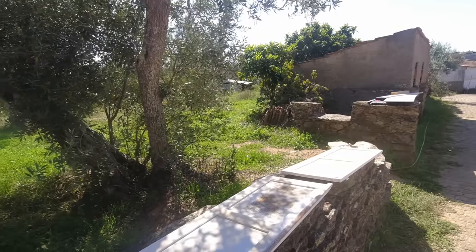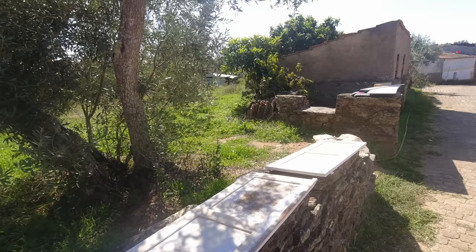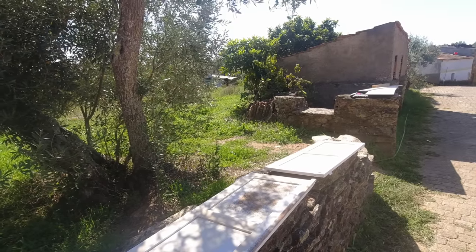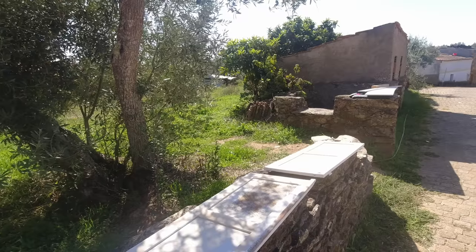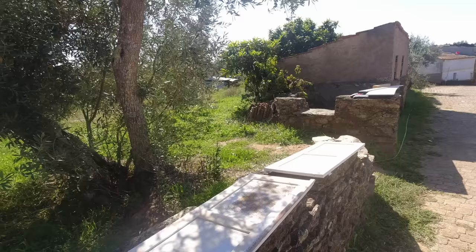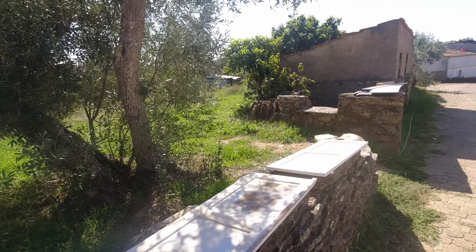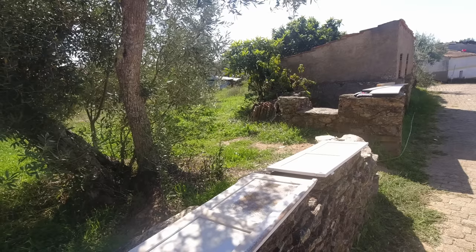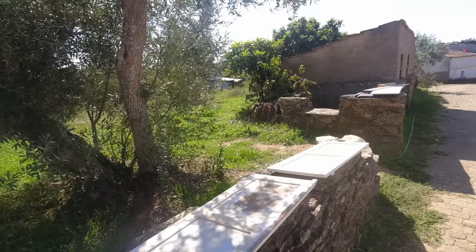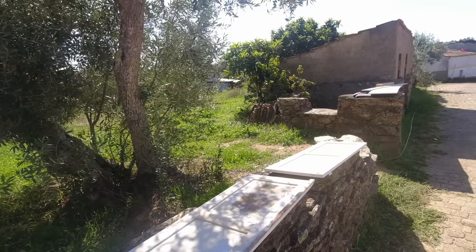Here's my workstation under the shade of an olive tree. I'm just painting up the shutters — they're quite rough, not the most fabulous, but they do an excellent job. They were all painted dark brown like the rest of the wood in the house, so we sanded them yesterday. Now I'm just giving them a quick coat of emulsion, and next time we go into town I'll look for some gloss paint for a top coat.